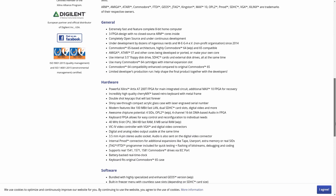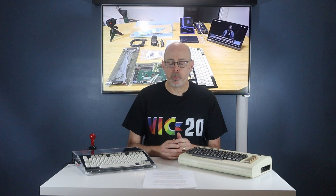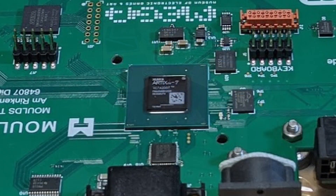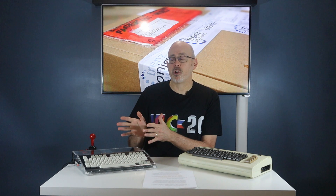So what's in this thing? It has a Xilinx Artix A7-200T FPGA that functions as a 40 MHz 8-bit processor to support both C65 and C64 modes — much like the Commodore 128. What's great about the FPGA is it has more than one core, which means the Mega can actually emulate — it's more of a hardware recreation of processors — but it can emulate more than the C64 and C65. You can add additional cores. This FPGA could also become an Amiga computer if somebody were to build that core.